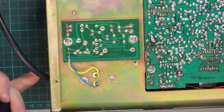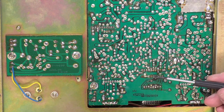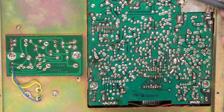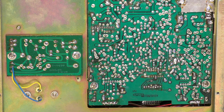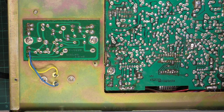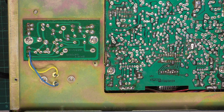One of the other things which I see, it's had an awful lot of work. It's had the synthesizer IC replaced, audio IC replaced, work all over the place. We'll be going over that with isopropyl alcohol, as I will with our own soldering. I'll just put this together, and then we'll test those four capacitors that I've changed.